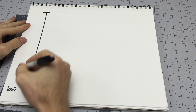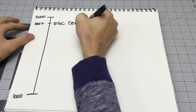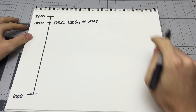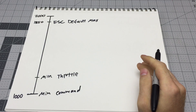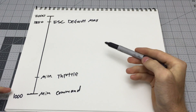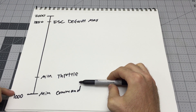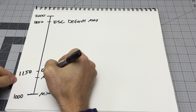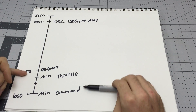The way speed controllers are told what to do is they're given a signal with a range between 1000 and 2000. The flight controller tells them what to do by giving a signal between 1000 and 2000. Due to a couple of reasons, the defaults are usually a bit narrower, and I like to widen them to 1000 and 2000. Normally, when the quad is unarmed, the flight controller gives the ESC the minimum command — usually 1000. When armed, it bumps that up to the minimum throttle value, the slowest speed the motors will reliably spin at. By default, this number is actually pretty high, like 1150, making it hard to descend.